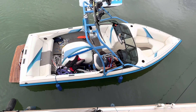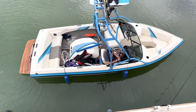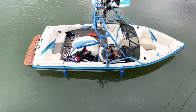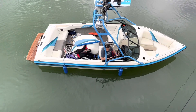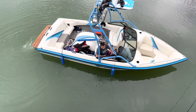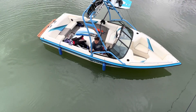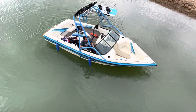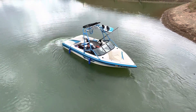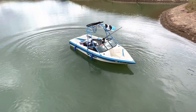...and hit a little forward, the boat starts to rotate. If I go left and hit reverse, the boat starts backing up right. If you see the boat starting to rotate the opposite way that it wants to back up, you can work it around. So now if there's a boat there, I can get out no problem. Even when you're in reverse with the wheel turned left, it might back straight — it might still back a little right, but it's going to go back less right.